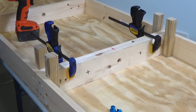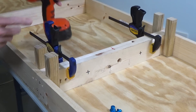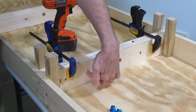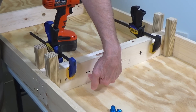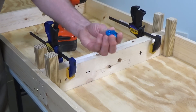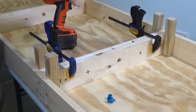That's got them perfectly aligned. Now, the next thing is to take your drill bit. What I have here is a 1/8-inch bit. The idea is to go ahead and mark two positions on the end boards and drill a hole right through board to board — one 1/8-inch pilot hole in diameter that goes all the way through on both sides. Then we'll be able to drill the mating holes for mounting the dowels using those pilot holes so that they'll be perfectly aligned after the fact.